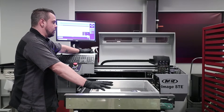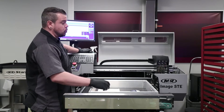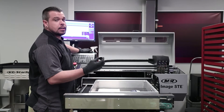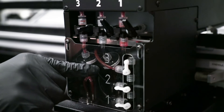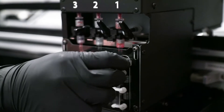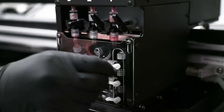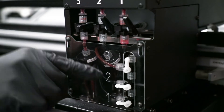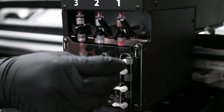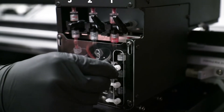This process, depending on your machine, can take anywhere from one to two minutes. And if you do have an extremely clogged filter it's going to take a little bit longer. Once I see that my line is completely clear, I'm going to put that back. What I'm doing now is just dripping the flushing solution out of the printhead. Now that that's done, I'm going to close my number three valve and walk over to start taking some stuff apart.